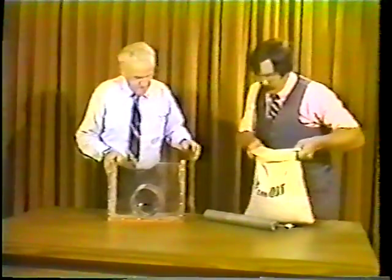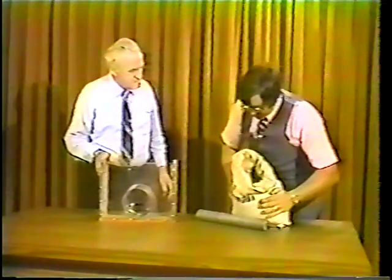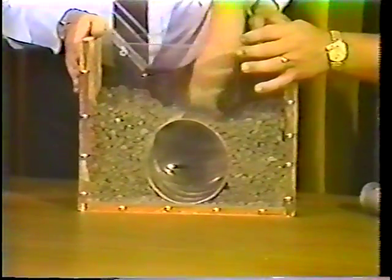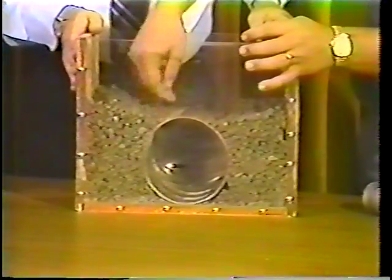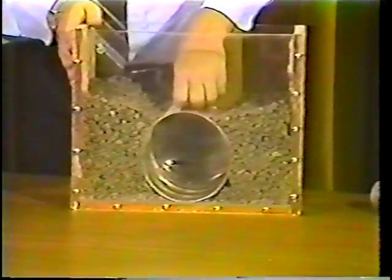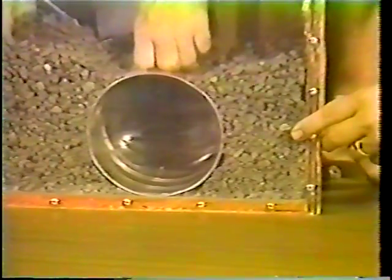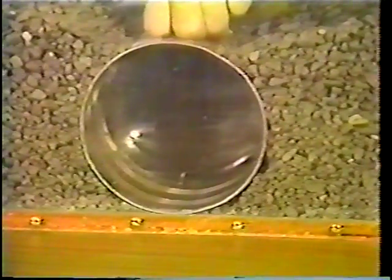Well, we brought along a bag of graded down 2A to simulate the apply of force to the top of the pipe here, Bob. Which would be the same as traffic going over the pipe. Same as a loaded truck or an automobile. And I just push down. Just give that a good push there. See how it's moving here, Bob? We're starting to get voids. Look here how it's starting to work along here. The more times the pipe goes down, the bigger the void. And this is just the result of not compacting. Right. This is the wrong way.